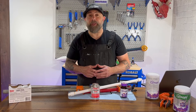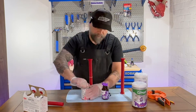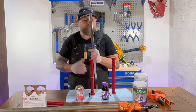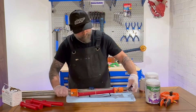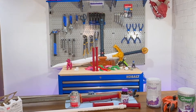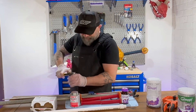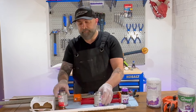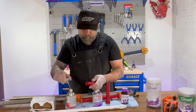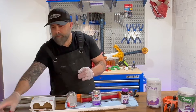While we're bonding everything, let's talk about how 3D Gloop and PVC glue work. They serve similar purposes in bonding materials, but do it through different mechanisms. 3D Gloop is a specially formulated adhesive designed for 3D printed parts, particularly those made of plastics like PLA, ABS, and PETG. It works by slightly dissolving the surface of the plastic, creating a strong chemical bond between the pieces once it dries. PVC glue, on the other hand, is used primarily for PVC pipes and fittings, but there are versions that can be used on ABS. It functions by softening the PVC surface, allowing the pieces to be fused together as the solvent evaporates, forming a solid bond. Both adhesives create strong, durable bonds by chemically altering the surface of the materials they work with.